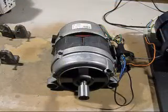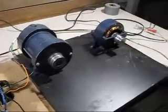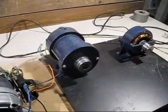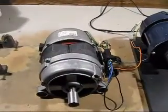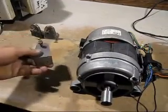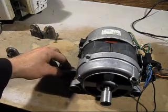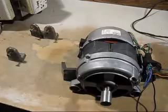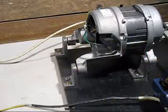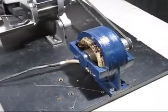Here's what I'm going to use the series motor for. This is an old motor driving my experimental alternator — I'd like to replace it with the series motor. I cast up some brackets a few weeks ago in iron and put mounting feet on the motor. The series motor is now mounted with the brackets and ready to drive my four pole alternator.